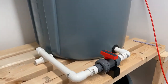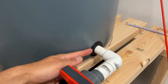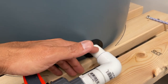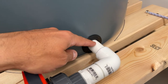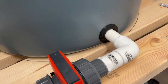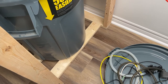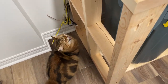I'll wait for the glue to dry and then fill it up with water. We'll keep an eye on the uniseal — the only thing maintaining the seal is friction, where the hole is slightly smaller than the three-quarter-inch PVC so jamming it in pushes the rubber against the container wall. One good thing I did in the basement redesign was install vinyl flooring, which is pretty much waterproof and can handle spills. Here's my cat Stella saying hi!